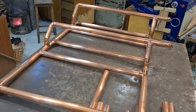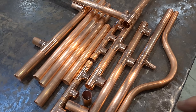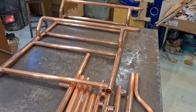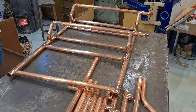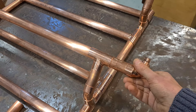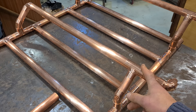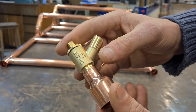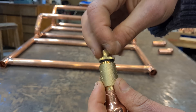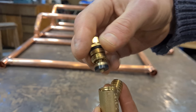There it is, nothing soldered yet. I'm making some bits to change 22mm to 28mm in T-format, and I think we can put this together in the meantime. So these are going to be little shelves right up the top. Each of them needs a vent unfortunately, because they go higher. That's going to go in there like that, before soldering any bits like this of course. We do need to take off any rubber sealy bits.